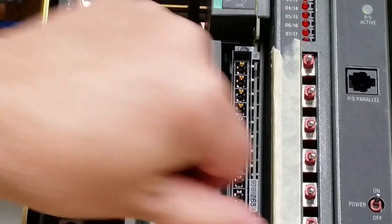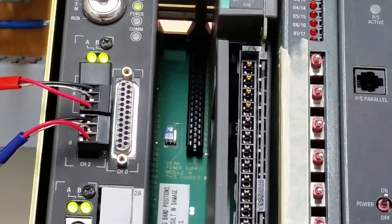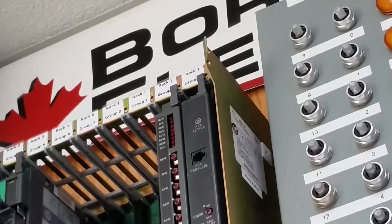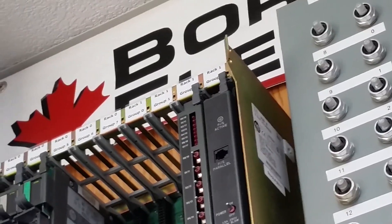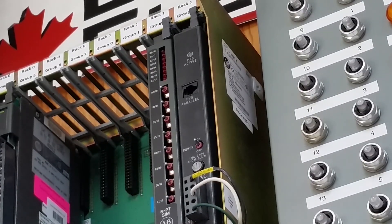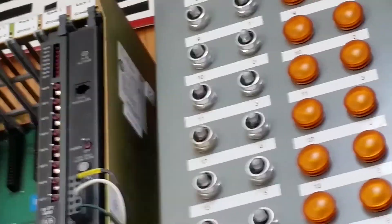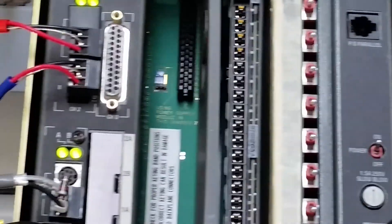They don't. On this card I turn on the bottom two switches, and looking at our other processor up there, you can see there are no lights on. If I take the next two switches, you can see each light on the simulator card comes on and they go all the way back down — 5, 6, nothing happening, and 7. So there's obviously something wrong with the communication on channel 1B.